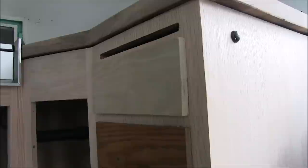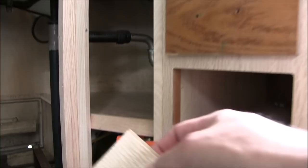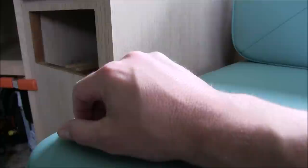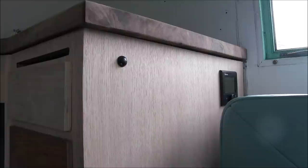What I had to do was remove the cabinet out of the trailer and sand down the finish. The finish was very rough. I had to sand it all down. The veneer is really, really thin, and it has a 3M self-adhere back. After you prep and clean the surface, you lay down the veneer on top of the existing veneer and roll it out.